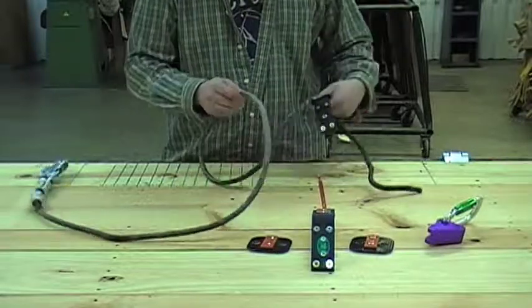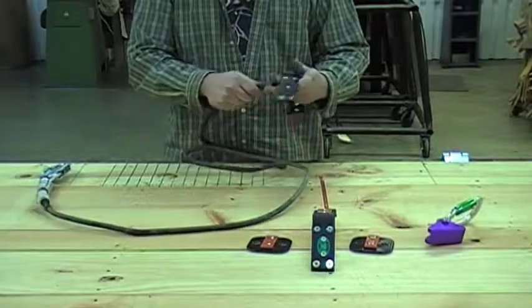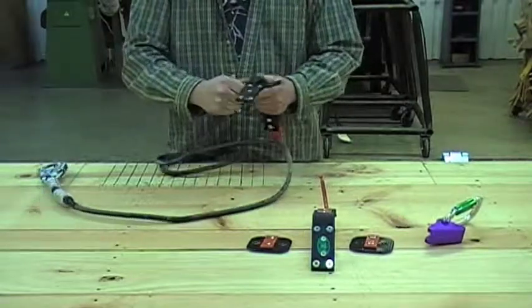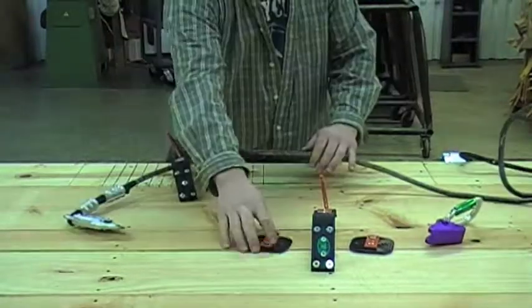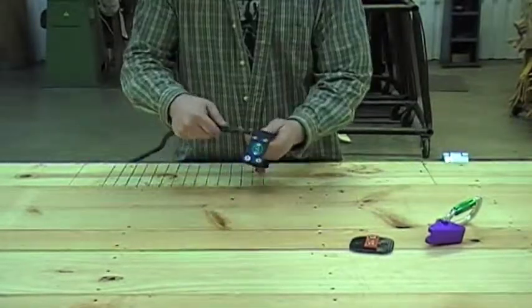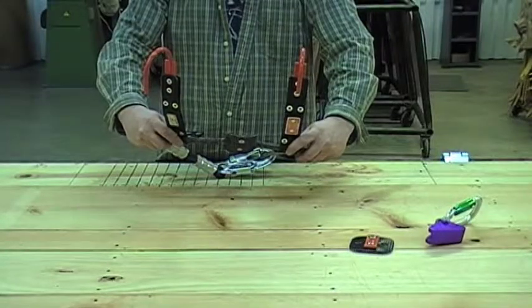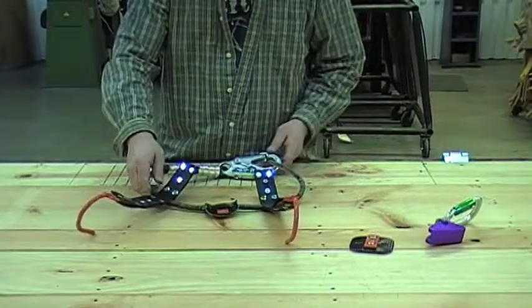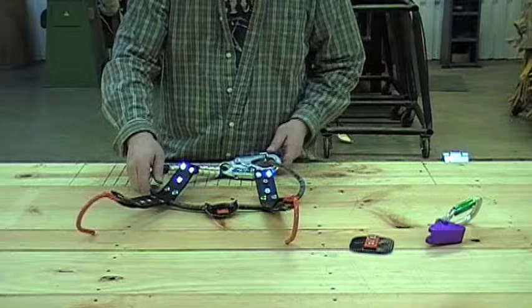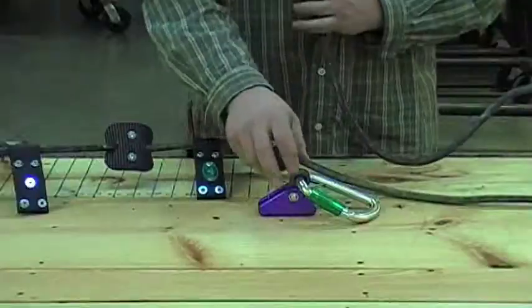Now lay the rope out on a work table with the snap hook on the right. Slide the first handle onto the pull rope as shown with the open part of the hook up. Now place the spacer tab onto the rope, followed by the second handle. Before going any further, check to be sure the handles are correct by connecting the snap hook onto the pull rope and verifying the handles are mounted so the open part of the hook is as it would be when it is on the pole. If everything looks right, put the parking tab onto the line.